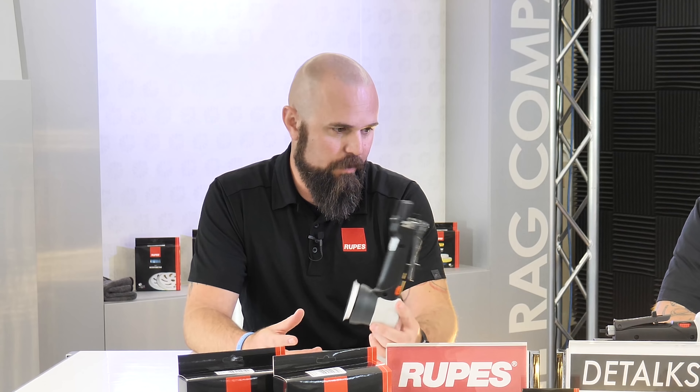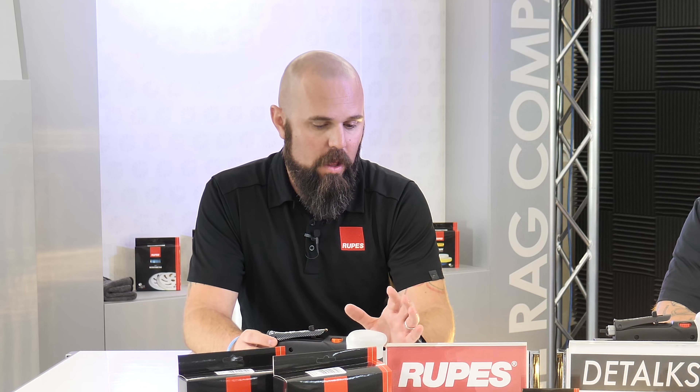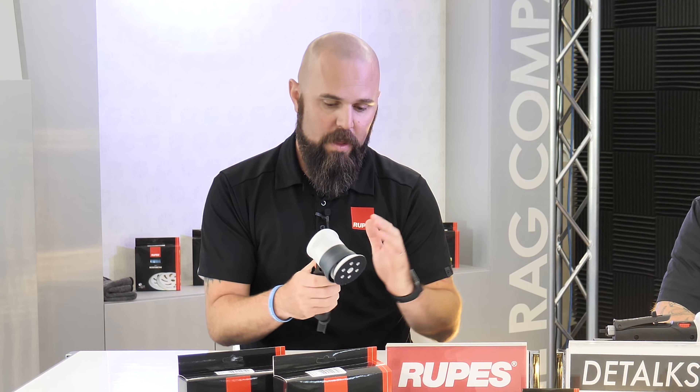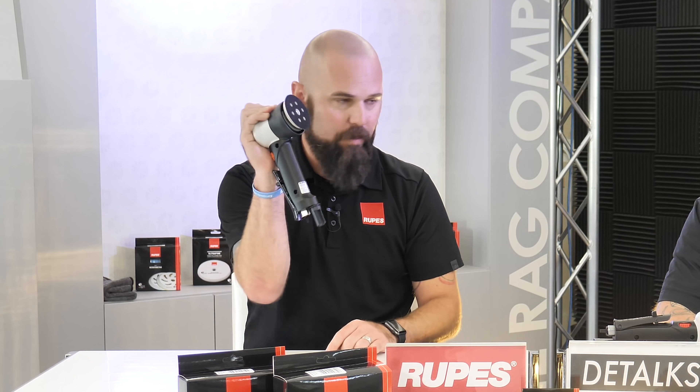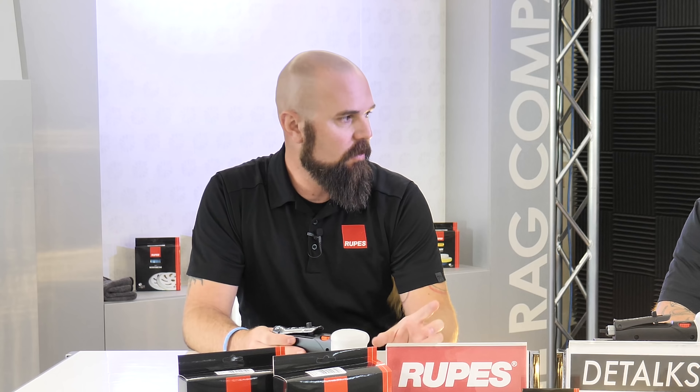You need a good air compressor because not only will it benefit your shop, then you get to use cool air tools like this, use things like the Tornador, and work more efficiently. In terms of polishing specifically, an air tool has far fewer moving parts and fewer things to break. The body of the tool is just there so you have something to put your hand on — all your working parts are up top. Essentially all you really have are the vanes within the air motor and some bearings.